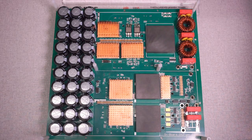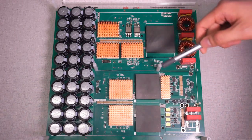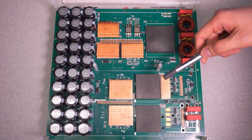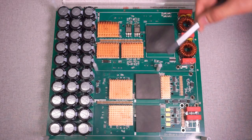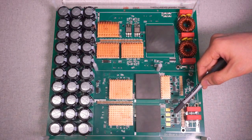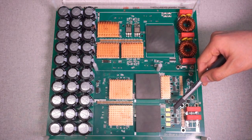The PFC is switching at above 300 kilohertz, and the resonant converter is operating at around 500 kilohertz. We use 1200 volt silicon carbide MOSFETs from GE, and 600 volt GaN transistors from GaN Systems. Both have an advanced surface-mount package, which enables the desired high switching frequency.